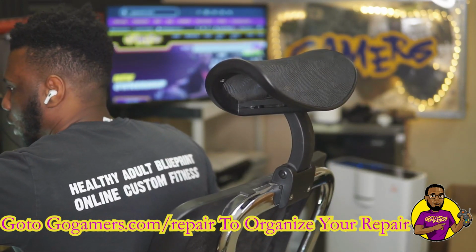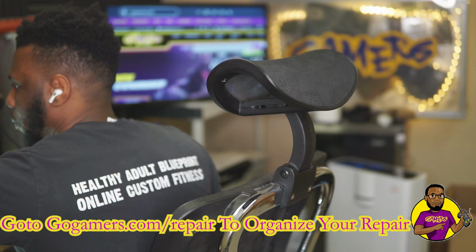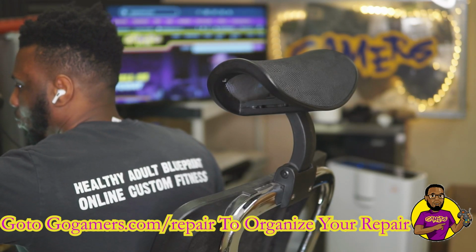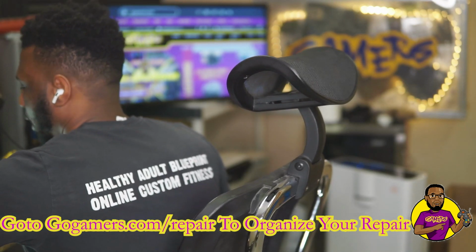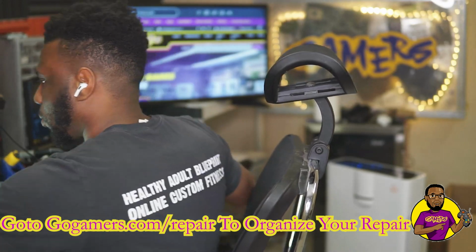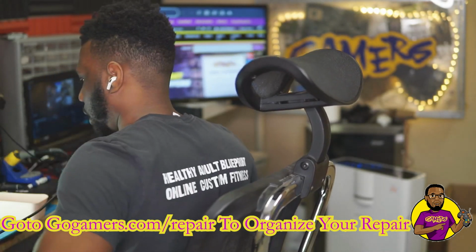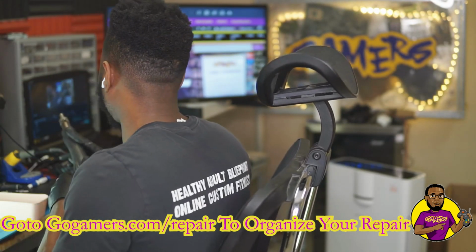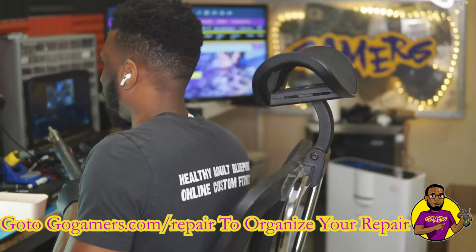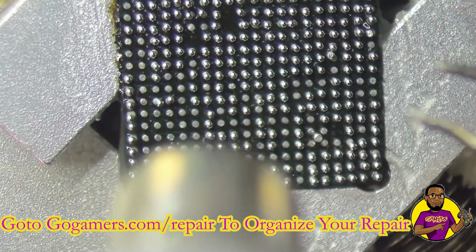So what I'm going to do is turn the heat all the way down and turn my airflow on high so I can maneuver some of the balls out of the way a little bit. And then we're going to make sure all the balls are still intact, and then we should be able to solder everything down into place. So let's get that done.